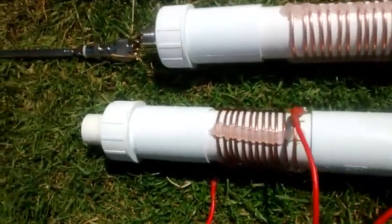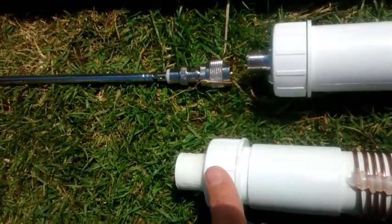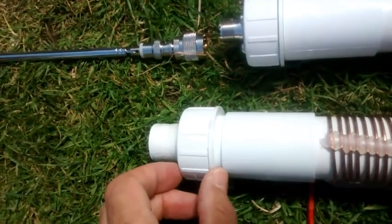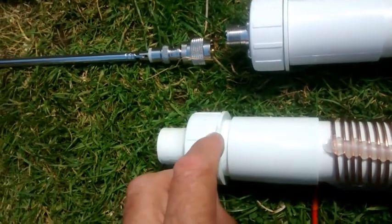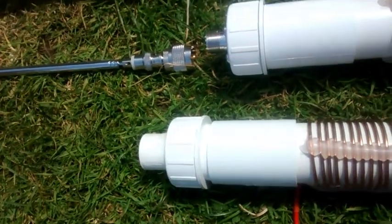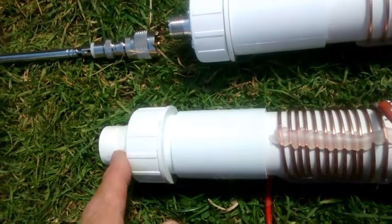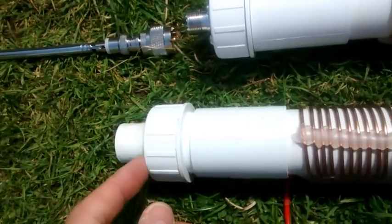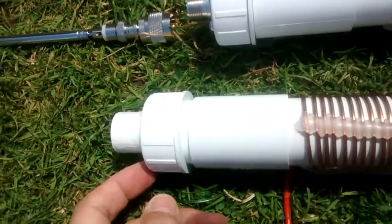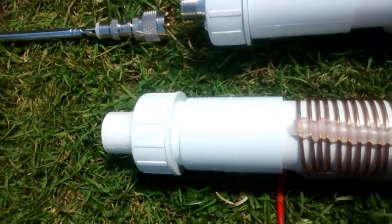This is the coil. I had a little bit of trouble with my fittings that I had to make up here. Originally I used a no-nails type adhesive, but I found that even overnight it had formed a skin and inside was still very moist, and I thought it would be months before that set. So in the end, I scooped it all out and used epoxy, but I made certain to put the wire brush all over the fittings and rough them up a little bit, to make sure it had a good fit in there.